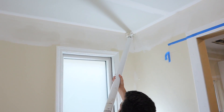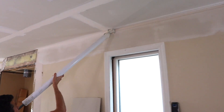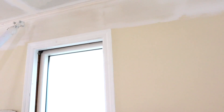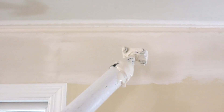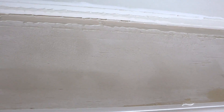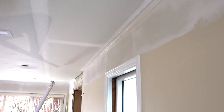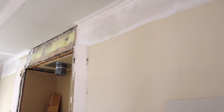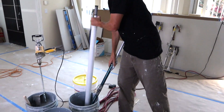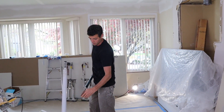Right here you can see it's not bad — it's probably a little thin. Right there is kind of just what you want, and down at the end is way too much. I think I'm going to need just a little bit more right here. I almost feel like I have my mud a bit thick because of how hard I was having to work there. Before I do the whole room, let's flush this out and see how it looks, because I'd rather get it a little thinner. I should be able to run around the room faster than that, which is what makes me think it's a bit thick.